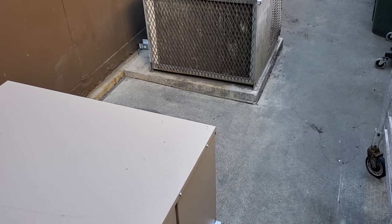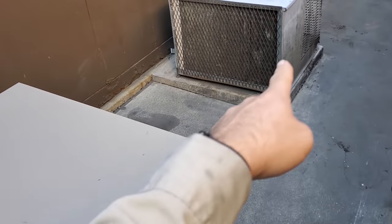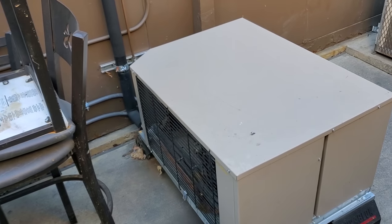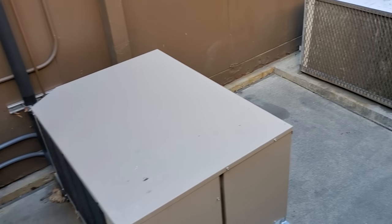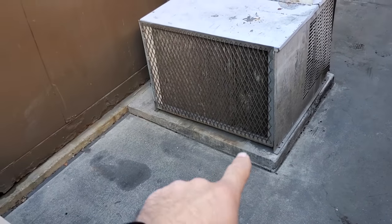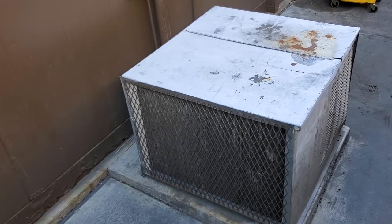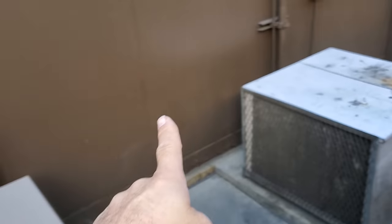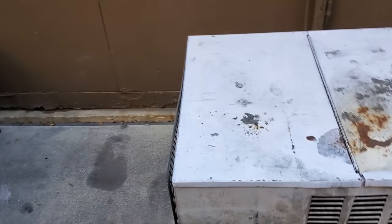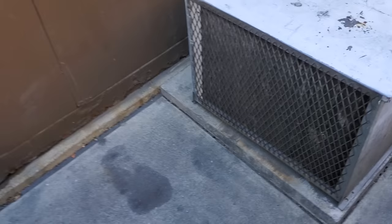I think I'm just going to build a stand where that pad is. My concern — my first thought was to put a stand directly over this unit so that way we had no possibility of the discharge air making it to this condenser. But I'm thinking that the location of this pad is decent, and I can put the stand right there. As long as the unit's higher, I don't think that the discharge air is going to fall down and go into that condenser. The discharge air would be blowing this way towards this condenser, but if I put it up on an elevated stand, it's going to be over that to where I'm hoping it wouldn't get blown into that condenser.